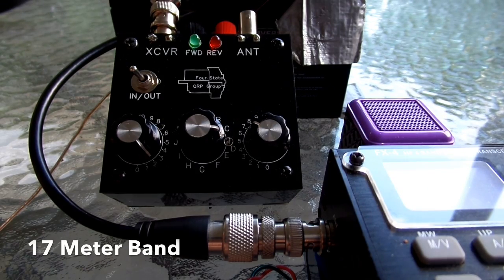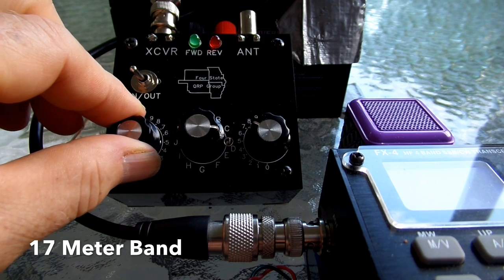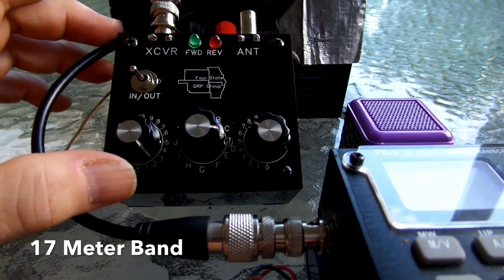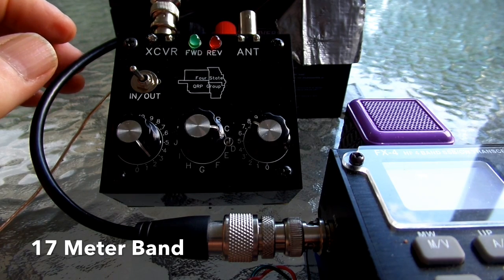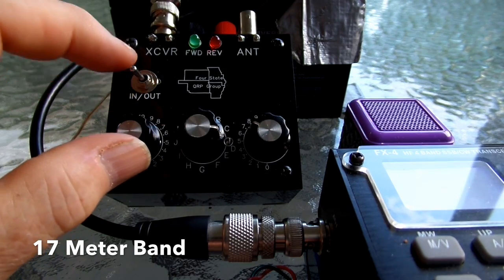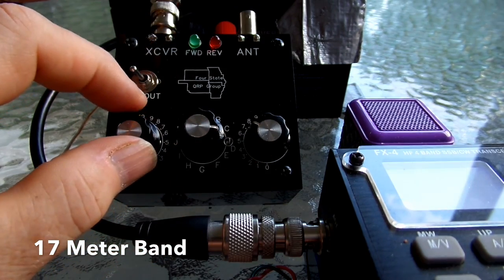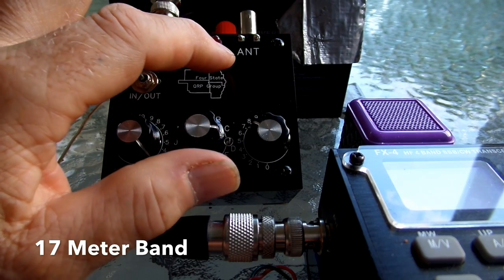And here we are on the 17-meter band. Right now there's no activity on 17 meters, but the antenna tuner works the same way. You can see that my output is lower on this band. The antenna tuners seem to work pretty much the same, even with a very short counterpoise. The advantage is that I have more selectivity with the inductance on this tuner, and I also have two capacitors — one that I can match the transceiver circuit as well as the antenna inductance. I also like the twin LEDs to show my maximum output on the green LED as well as the minimum SWR on the red one.